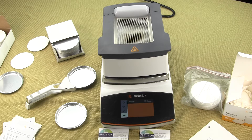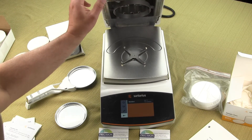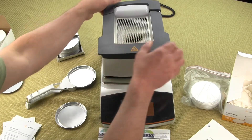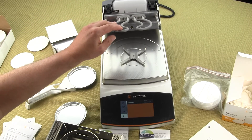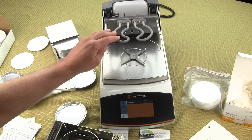So what are the differences between the MA 37 and MA 160, and why does one cost more? The MA 160 has a stronger heating element — it can output 600 watts while the MA 37 outputs 480 watts. More watts means a shorter time to reach the target temperature. The heating element uses a different alloy mix, and although it may look the same, this different alloy enables the MA 160 to output a maximum of 600 watts. Sartorius calls this the Aurora heating element.